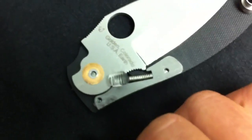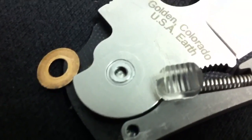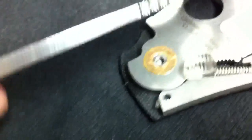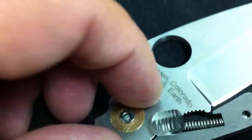That is the original pivot in there — it's been shortened perfectly and honed. I left just enough on there to catch the washer, so the other G10 comes down on top and that bearing still works just like it would from factory from Spyderco. I had to shorten it because we took out the thick liners, so roughly that much thickness came off the side of that pivot.